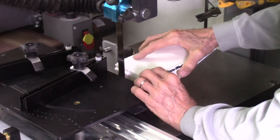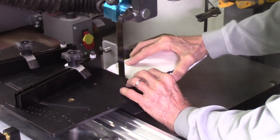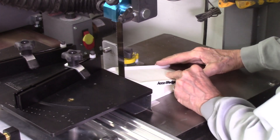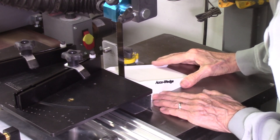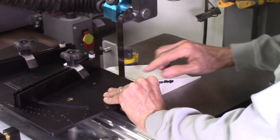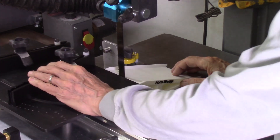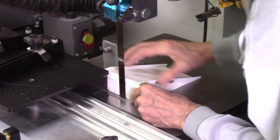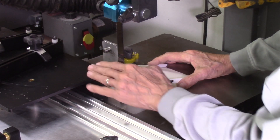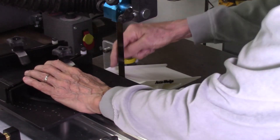Let me show you how we install this — by positioning it as such, placing that lip underneath the accu-wedge system, and then clamping it in place. I can move it slightly to align it if it's skewed one way or the other. I now have a gap of approximately 1/32nd of an inch between the ramp and the back edge of the accu-wedge table, and the ramp is about 1/32nd of an inch below the top surface to prevent boards from hitting the ramp. The bandsaw blade rests nicely in that gap, and these pieces help prevent parts from getting jammed down in there.